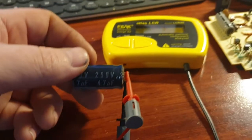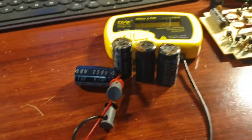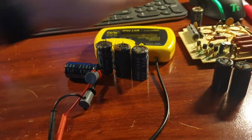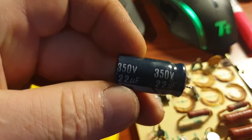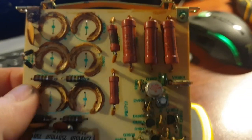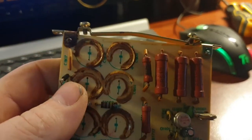If you're going to replace one, replace all four with these rectifier boards. They have a combination of four of these 22 microfarad 250 volt caps on one rectifier board, and on this rectifier board here they actually use some 350 volt — not 250 volt — still 22 microfarad but 350 volts. Ideally, clean all this gunk off. A lot of people ask, do you re-glue them back down? If the radio's not going anywhere and not going to be transported, generally no. A lot of this gunk just creates a problem later on.